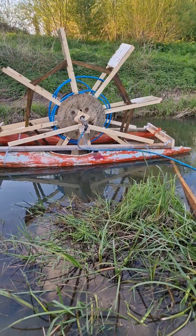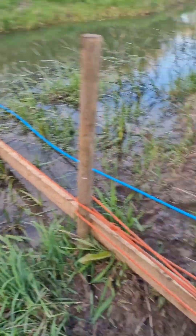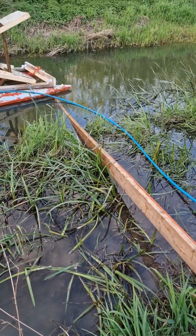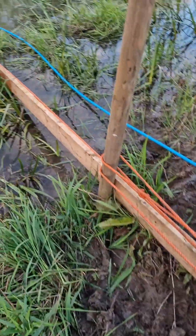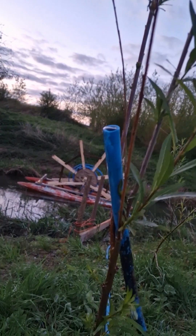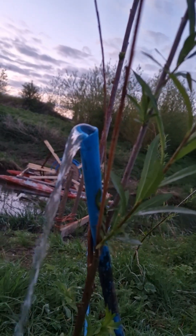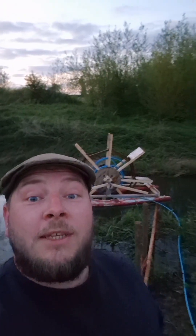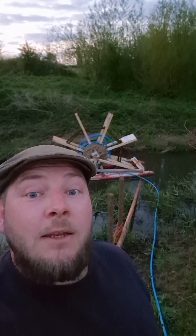Success! We have the water wheel spinning, filling up with water as we speak, and hopefully any minute now we should have water coming out the end of this pipe. I've just put a 6-metre 6x2 beam, pulling it right out into the middle as a temporary anchor — obviously if this works I'll make a slightly better version that can adapt to flood rise or whatever. Oh, and we've got water coming out — bloody brilliant! We're pumping about a pint of water per rotation. I'm literally going to add a couple of pieces of gutter to the bottom of the fin to get a better rotation speed and pump more water. If you enjoyed watching this, like and follow so you can see me make this even better and pump water all the way to the veg patch.